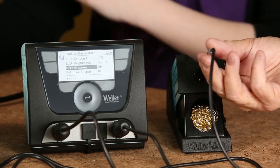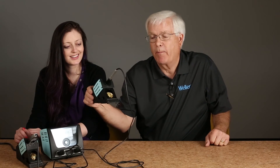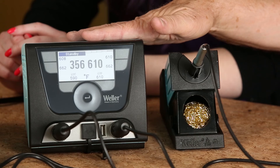These tools are smart pencils — they have memory inside the pencil. So if you have four or five of these set up down a bench row and an operator picks up a pencil and plugs it into another WX station down the row, the pencil will remember the settings and that will be updated into the station. Process engineers can also take the software, put it on a laptop, do all the programming there, save it to a flash drive, and plug that flash drive right into the port here to upload all those settings into the unit.